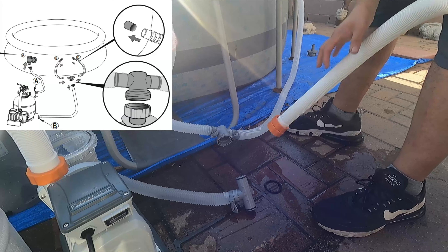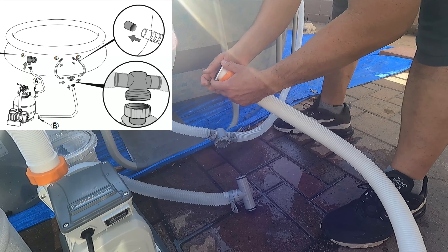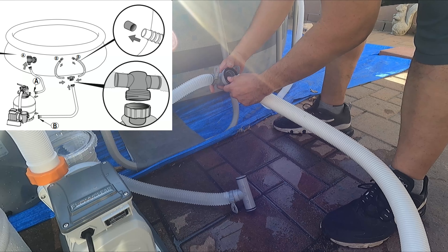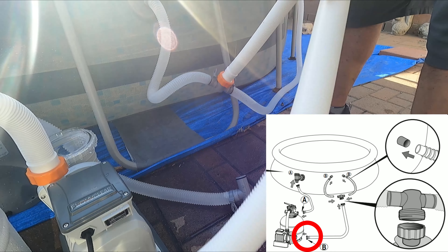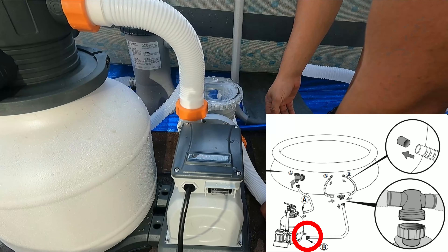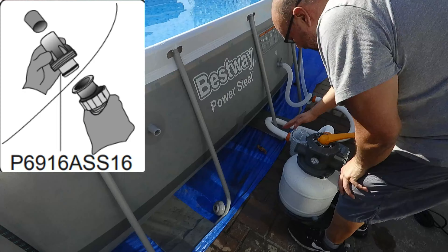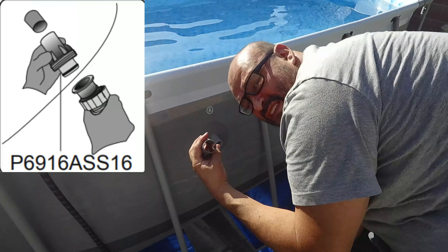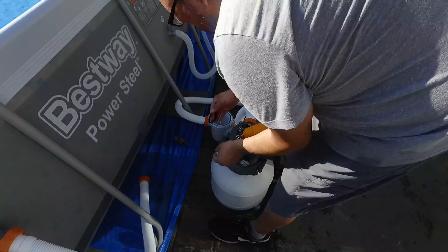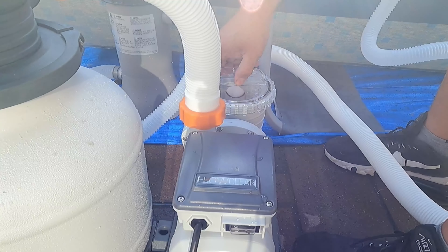We already capped it up on the other side, so we're going to drain the water out a little bit. Replace the old tee with the new one, cap it back, lock it in place. Make sure that one's in there, then remove the other one and unlock it. Grab one of the long white hoses — make sure you put this one in there, you guys can see it goes in here first with the seal. Now we go to the B section in the back.